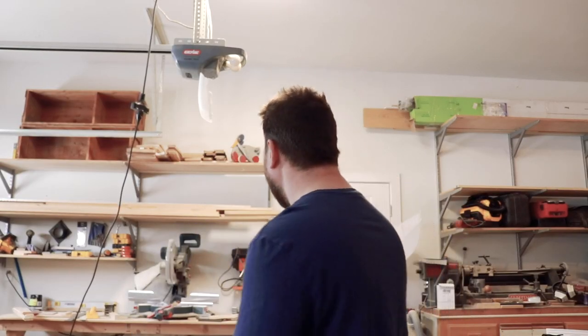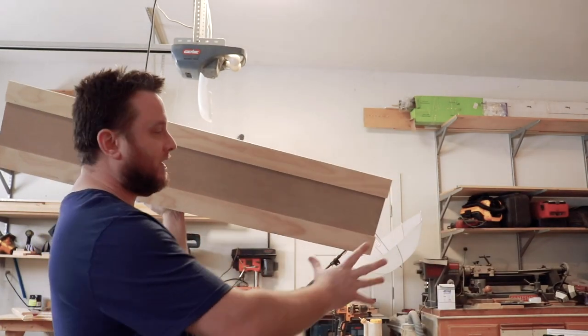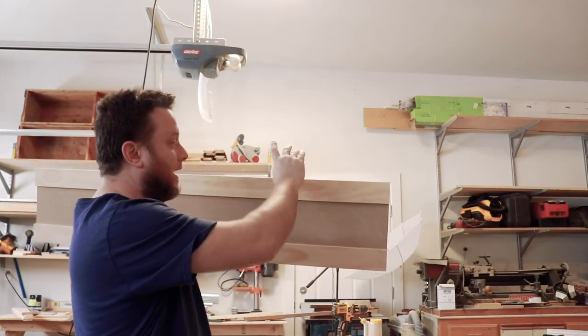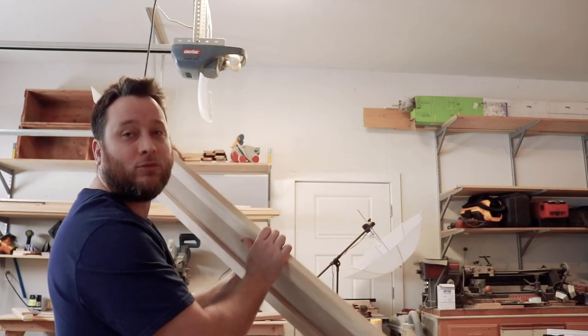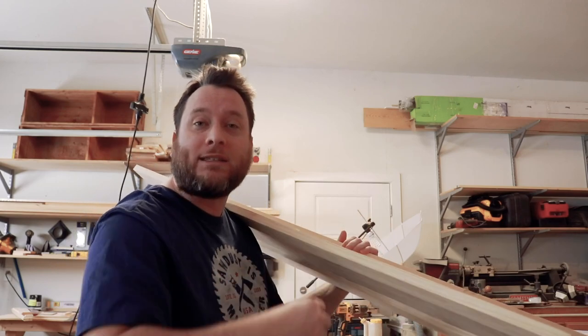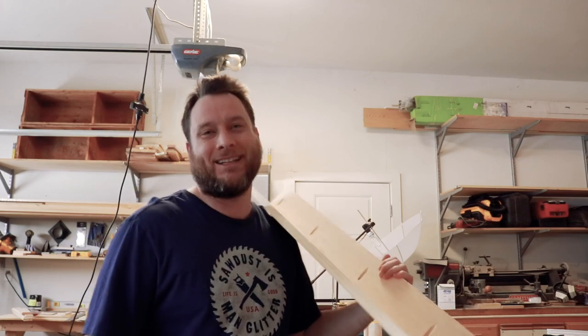Okay, so we finished the top part — here it is. This is how it's going to sit on your fireplace; you're going to have another column go over here and then your mantle is going to sit on top. I only put one skirt or bottom on it because you don't need one on the top — that's where your mantle sits and you need access to the inside for the installation. Now you know how to build the top, let's go build the sides.